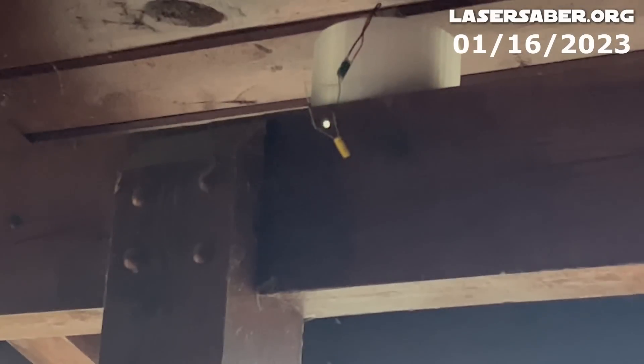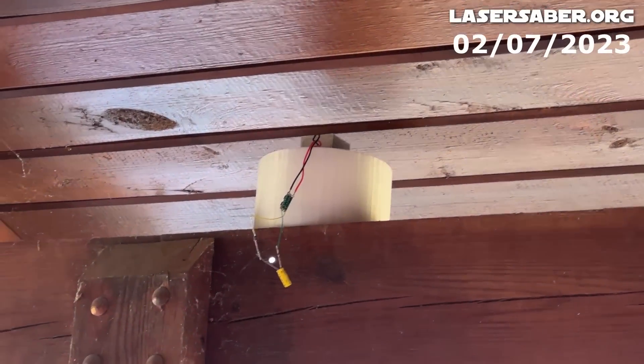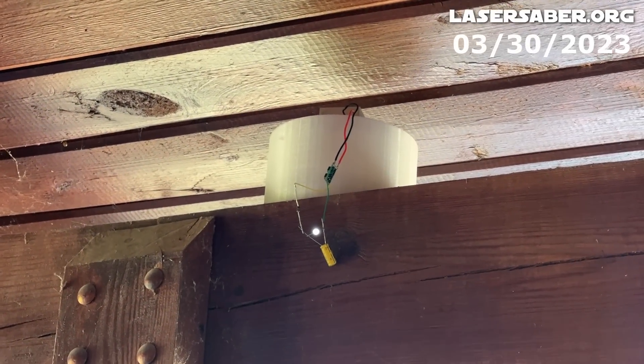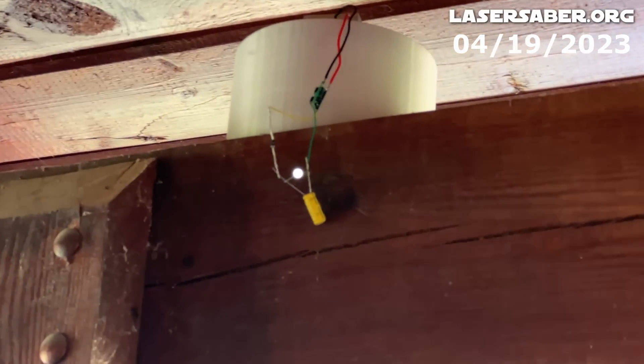I went on a trip over the weekend, got back and the LED is still on. This thing stayed on day after day, week after week, month after month. I don't want to give the wrong impression — it wasn't on nonstop all the time. There were some rare occasions where the temperature was static over a long enough period that the inside core was able to sync up with the outside temperature. But in general, this thing was lit all the time. Now it's important to keep in mind that we were not capturing the full amount of usable energy, because this LED was essentially a drain-off for overvoltage protection on the supercapacitor. The bipolar voltage booster has a maximum output of 10 volts, which is far higher than the supercapacitor's 3-volt maximum. So the LED was really there just to keep it from overcharging — there really was a lot more potential usable energy than what's being demonstrated here.